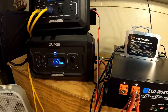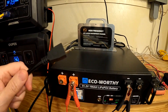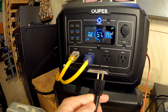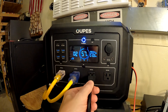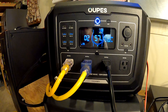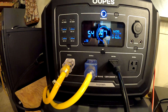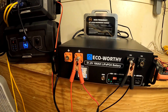Lastly, I'll show you real quick how we can actually recharge this rack battery off of this solar generator. I've got the battery on, I unplugged it from the solar there. We've got our charger, and I'm going to plug this in with the air conditioner and other stuff still on. We're already pulling 553 watts, and this is probably going to add about 1,000 to that. It should ramp up kind of slow — we might get a spike. There you go. Now we've got 2,000 watts to work with here, and we're recharging.